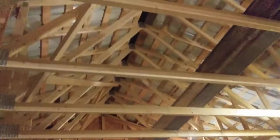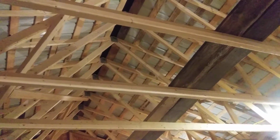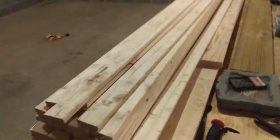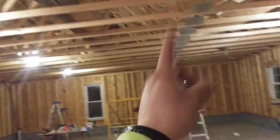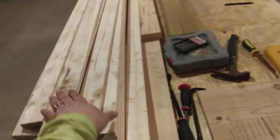Pretty soon, the idea is 2 foot centers, you can run 5/8 sheetrock, but no matter what you do, double screw it or whatever, it's still gonna sag, and eventually you'll be able to see your sag marks. So we're gonna strap it every 16 inches with just furring strip. It's like 3/4 by 2.5. So it'll be this way the entire way down through. And then I'll double screw to this.